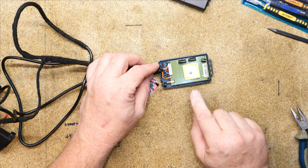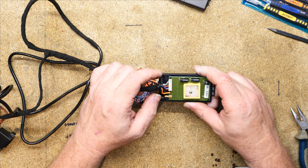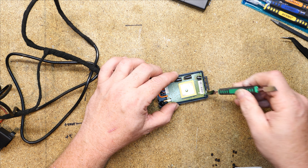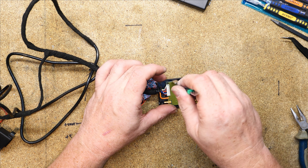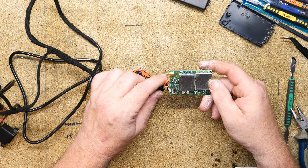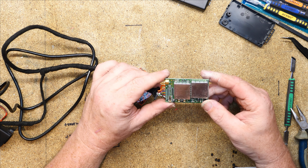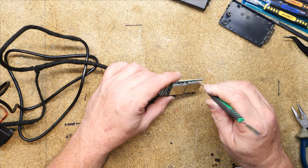That's a good start - we have a GPS patch antenna there, and this is all heat-staked together so we know what we do with the heat-staked stuff. We put a spudger underneath it and snap the ends of the heat stakes off. Oh, there's a lot more in here than I was expecting. So I was expecting just a GPS receiver - I suppose that could still be just a GPS receiver.